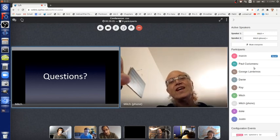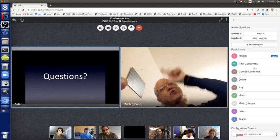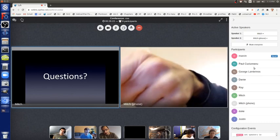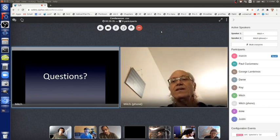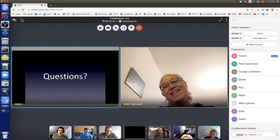Yeah, and the ceramic resonator right here isn't required, but it makes it a little more complicated in your development environment to use. If you have it, then you can use any Arduino, take this chip out of the solderless breadboard, plug it into an Arduino board over here that's connected to my computer, program it with the free Arduino software on Windows, macOS, or Linux, then plug it back into here and it will just work. If you have no ceramic resonator, then you've got to do a little bit of mucking around on the Arduino development side before plugging it back into here. But it is possible.